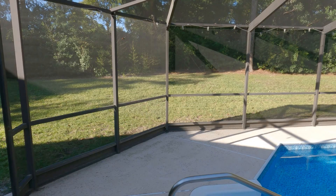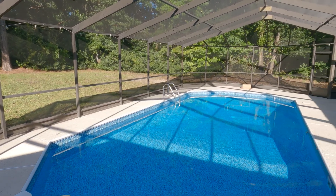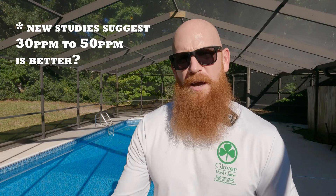While doing this I always keep a close eye on my cyanuric acid level. If it starts to get too high, it's time to back off the tabs and switch over to cal hypo for a few weeks. Let the rain and splash-out from swimming bring the cyanuric levels back down to an appropriate level, and then I can go back to using tablets again. I keep my cyanuric acid around 50 to 60 ppm. Here in Florida we have pool service year-round, so I use the winter off-season to let cyanuric acid levels come back down to the lower end of my range — that way when summer comes back around I can slowly build back up into it again.